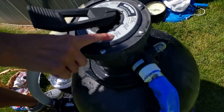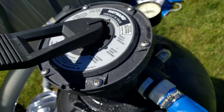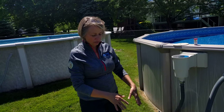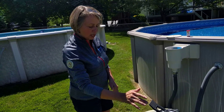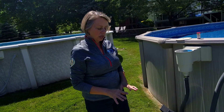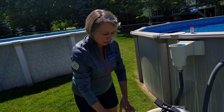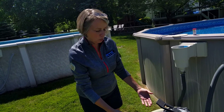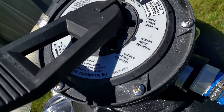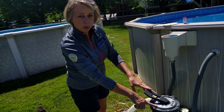Your next setting is your winter setting, which means just what it says. Your winter setting is what you're going to set this on in the wintertime when you're all done with the pool — hoses come off, everything gets disconnected, the gauge comes off, the drain cap comes off the bottom, and then you're going to put your multi-port in the winter setting. What that's going to do is allow just enough of an air pocket so that as any residual water in there freezes and expands and then thaws again, you'll see little droplets coming out in the winter time — that's good, it's giving it a place to move to. If you are on the closed setting in the winter time, you stand a chance of cracking your filter, because if there is water in there and it has no room to expand, it can crack the filter. Closed is usually what we use when we're servicing the filter.